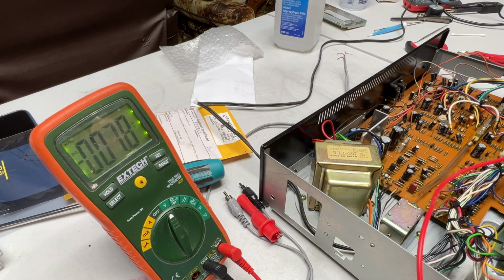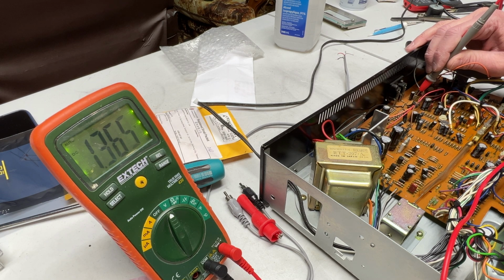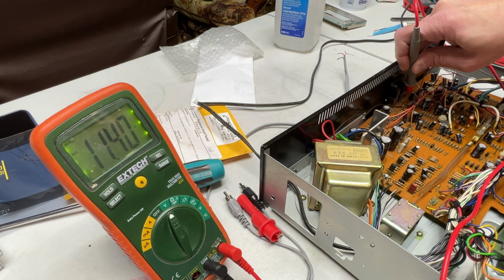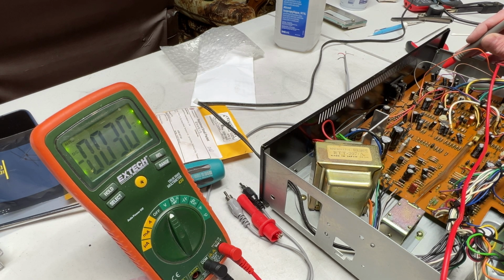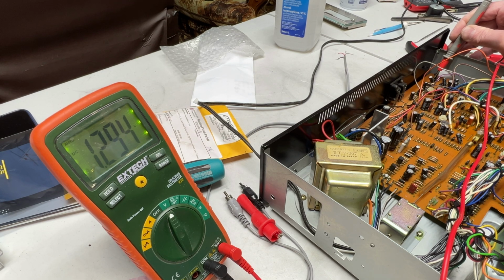I'm going to rewind the tape just a bit so we can make sure the signal doesn't run out while we're probing. Okay, so this is 149 here. 1.36 volts that side. What about the other side? 11.3 volts. So the next one is over here. Ooh, millivolts. What about the other side? 1.3 volts.